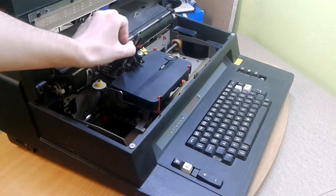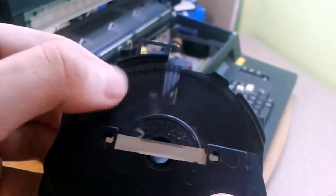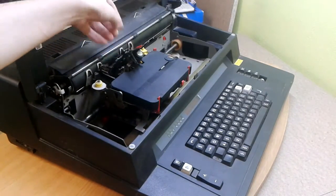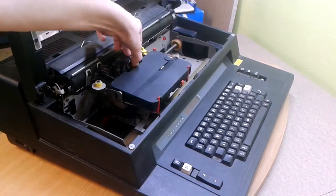As you can see, it also has a big sliding carriage with a printer head and mechanics in it. The individual letters are printed with this ring and solenoid hammer. The letters are not ordered alphabetically but in strange patterns. I assume its position is given by a statistical analysis, so that the most used letters in your language are nearby.